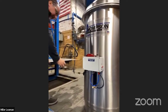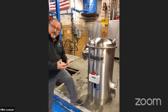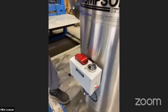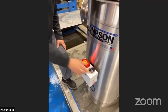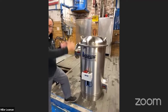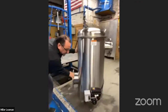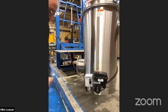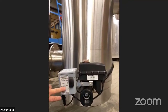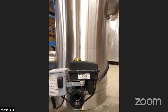This is 110-volt electrical - it works for both the automatic timer flush and the pressure differential alarm. From the factory, it's set at 7 PSI. There's a setting right here in this gauge you can adjust - if the pressure differential builds up and hits 7 PSI, a light will blink and an alarm will sound. You could also reset that, and then you would need to perform maintenance on the system. You can also manually flush it by holding the manual flush button - the ball will actuate and flush the unit out, and as soon as you let go, it automatically shuts itself.